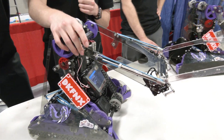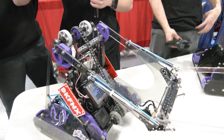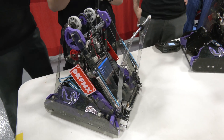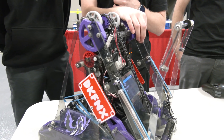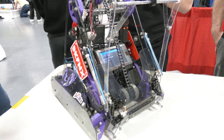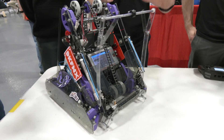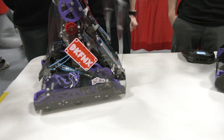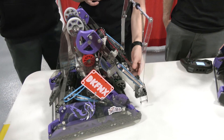Polycarbonate is something we also use a lot. For the lift, we started with aluminum but it was really too heavy, and if it took a shock it could break or bend. So we switched to polycarbonate sheet at a quarter-inch thickness — very, very thick and flexible — so if you get a shock, it doesn't break. We also use polycarbonate for the goal rush mechanism, because if it gets a shock it springs back into place.